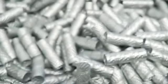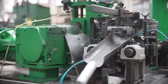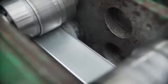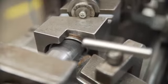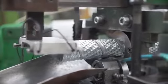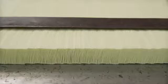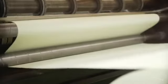We start with the filter cartridge. The filtration paper will be put on the reinforced core, which is made of a galvanized metal band. The machine makes perforations which serve as a screen for stopping the biggest contaminants. The filtration material is produced from resin-impregnated paper containing synthetic fibers, resistant to temperature differences and acids resulting from chemical reactions.